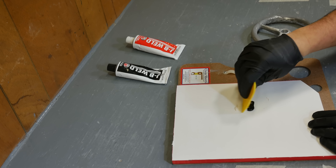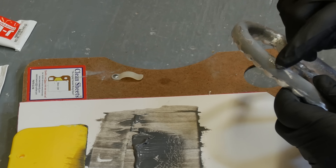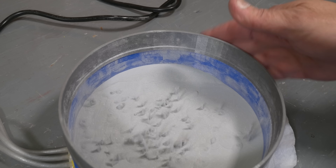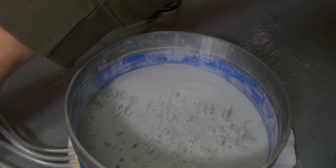I've done a little bit of sanding and filling to smooth out the wheels. We discovered that JB Weld holds up to the temperatures of powder coating, so it can be used as a high-temperature body filler for filling imperfections. I also printed an extension ring off-camera, just to give me a slightly higher barrier and keep more of the powder in the bed when it decides to channel and spout.